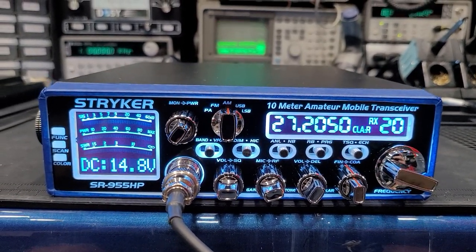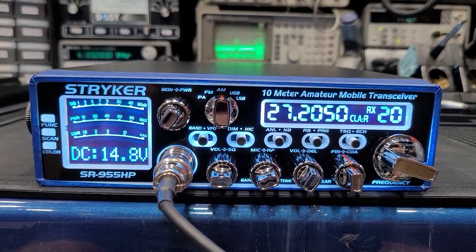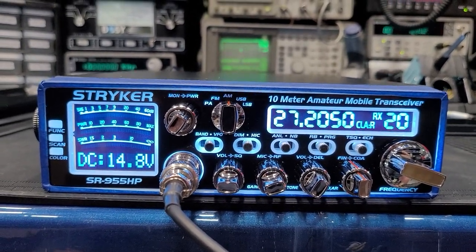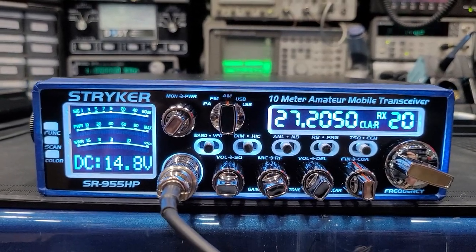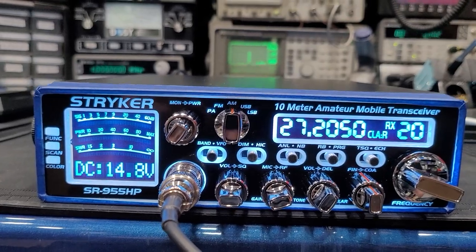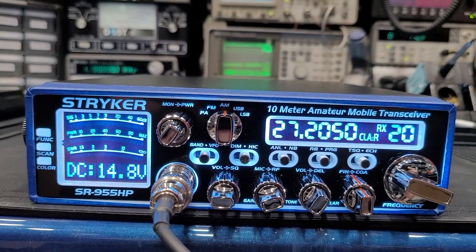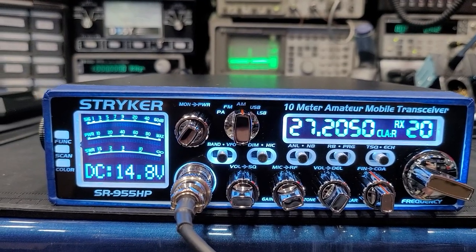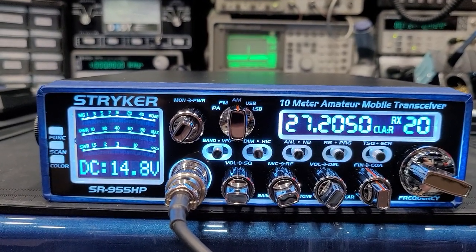I got your decked out Stryker 955 version 1 all done and completed for you. We have a full tune out done to this radio. We did not upgrade the finals because you're just going into a 2-pill or possibly a straight 4 and for pre-driver. So you won't need the extra output from the larger finals or more powerful transistors there.